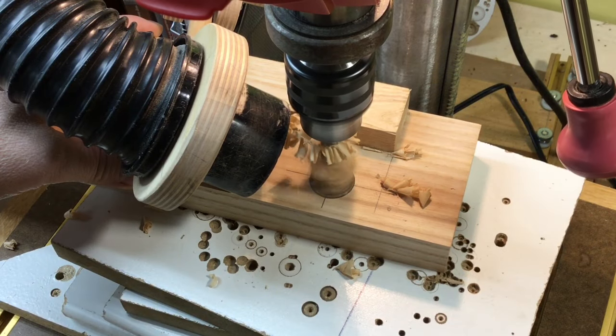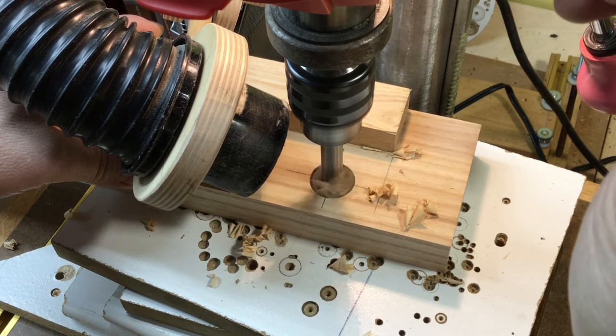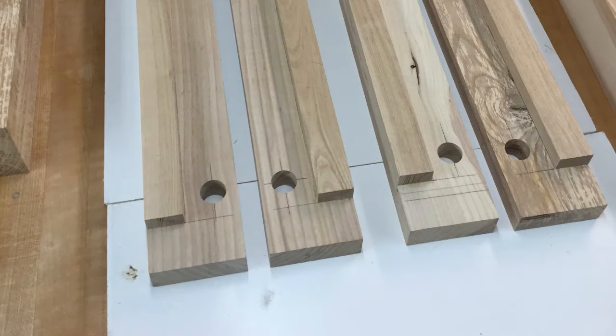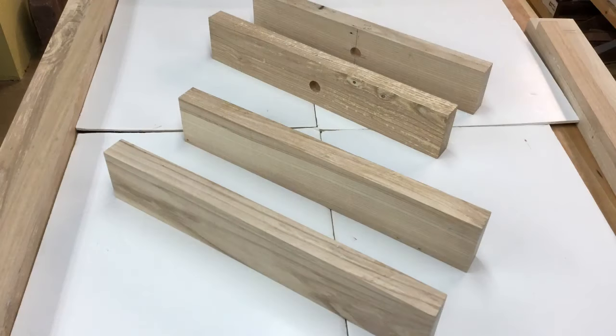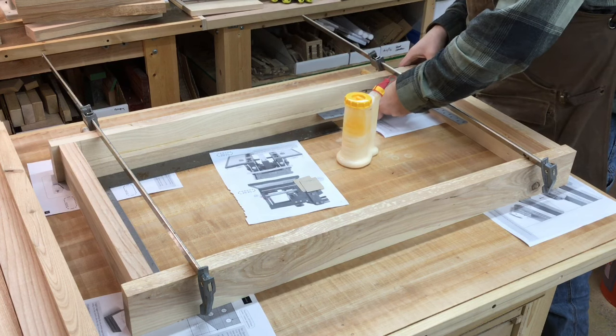On one end of each of the long F1 frame beams, a hole is offset from the rails that were just installed. The dimensions for these are all in the book. It is important to note that only one end of each of the frame beams needs this hole. The F2 frame ends are all cut to the exact same length. Two of the holes are for the top frame and are clearance for the lead screw. The frames themselves can now be assembled.